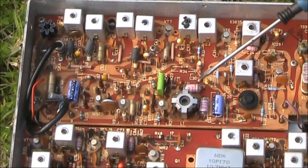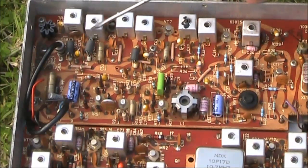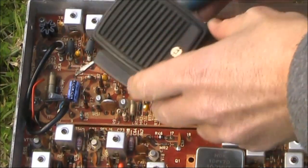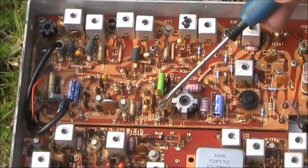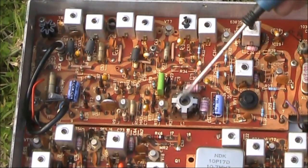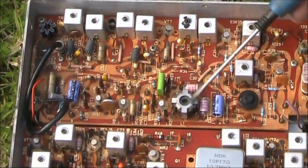Looking at this board, there's three main sections. We've already looked at the crystals, which are selected by another section of the channel change switch. Over here is just audio componentry, and up here, as you can see from the transformers, is more RF stuff. The audio componentry first amplifies the incoming audio from the microphone, and you probably need two or three stages to amplify the audio. Then you need to pull the frequency of the crystals a little bit to achieve your frequency modulation. So there'll be some form of frequency modulation stage in here — I'm not sure if it's direct FM or if it uses phase modulation, which can achieve a similar result. There might also be some audio shaping circuitry in here.